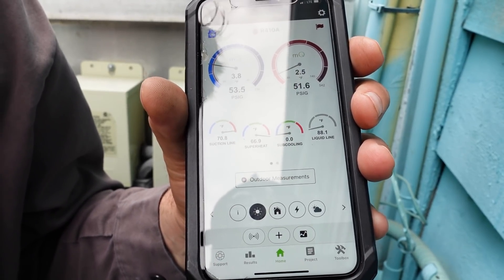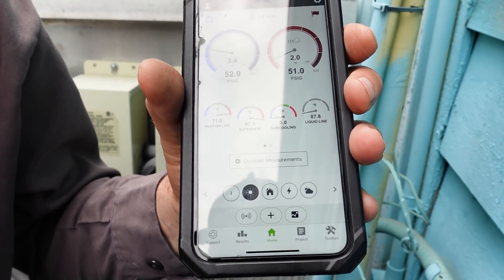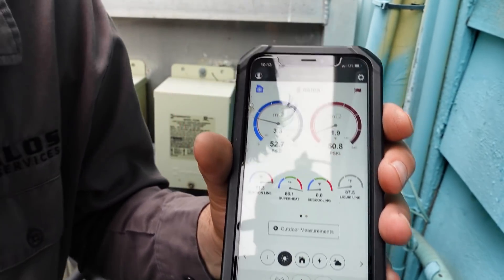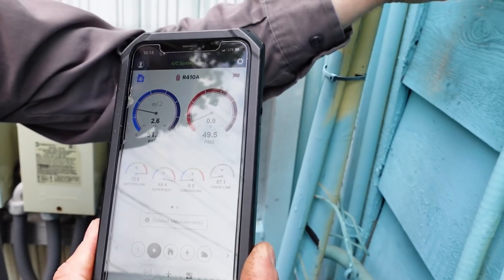But it should be at least either bypassing or pumping down a lot further, and it just stalls out right about here. And we can look at our liquid line and see it's not expanding — we don't have anything leaking by through the valve. So we're going to go ahead and shut it off here and show the next test.